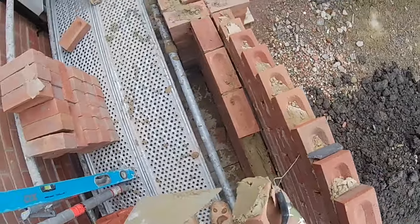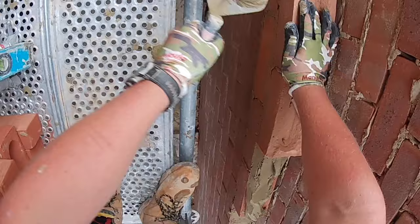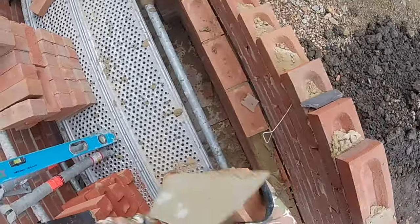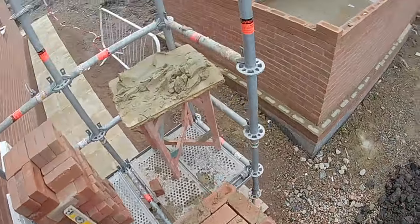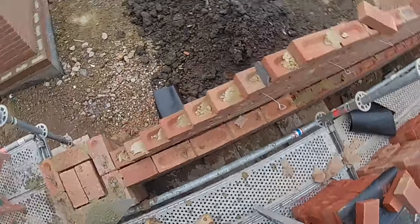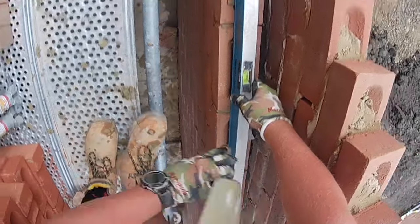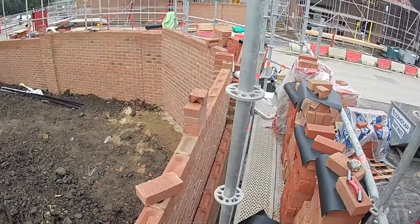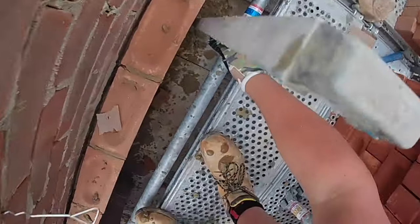Same again with the other job I've got, working off two lower scaffold lifts, reaching overhand, not being able to see what you're doing. Obviously what's occurred is a bit of bendy brickwork, not seeing the wall on the overhand side, so me having to straighten that up, that's all a consequence of bad scaffolding. It's not on really. It's not on for the quality of work they're wanting and what we're having to do to achieve that on a price, doing it dead cheap, in effect.